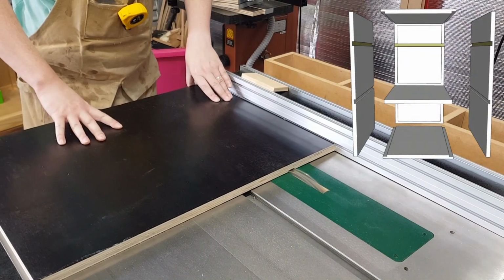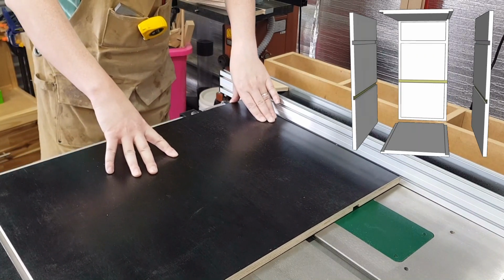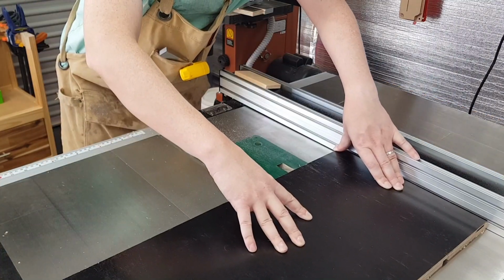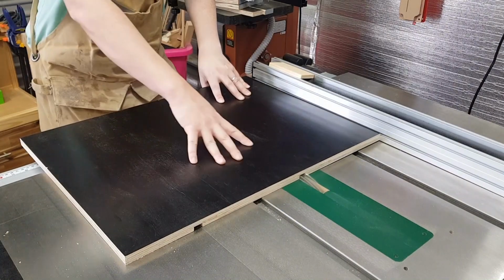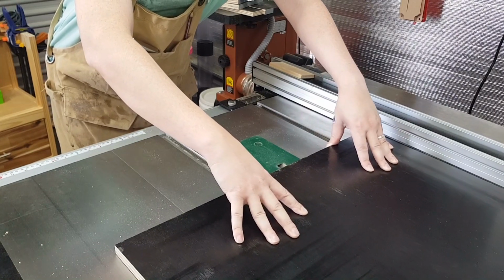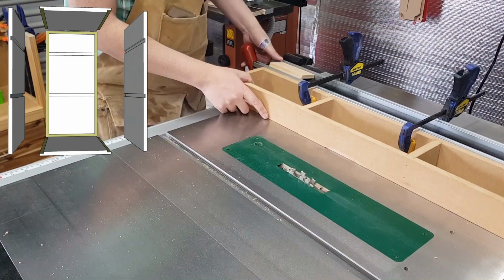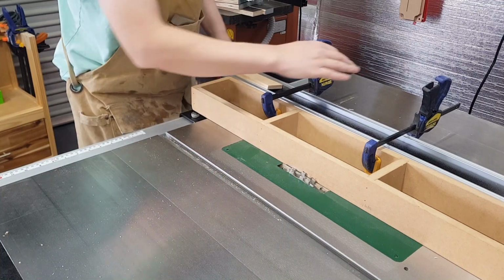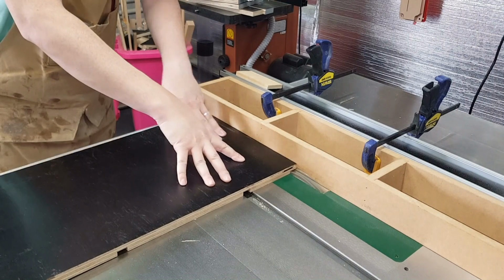The first dado position will cover the top section of the sides and back. The second will cover the bottom dado section. The final cuts with the dado stack are for the top and back panel. A sacrificial fence is used to ensure we don't damage our normal fence when cutting this type of rebate.